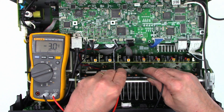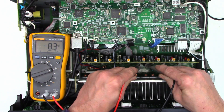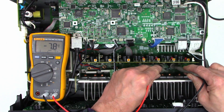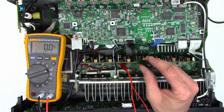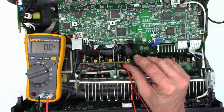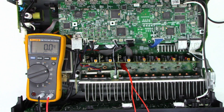This is the channel that has been repaired, I believe, and I've got 0.0 millivolts of idling current — that's not good. Readings on the other channels are 8.3, 9.4, 7.8, and 7.8. This is the one with zero millivolts and I should be seeing something right now. Regardless of where I put the pot, I get zero. That is a problem — something on this channel is definitely going on.